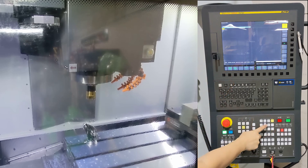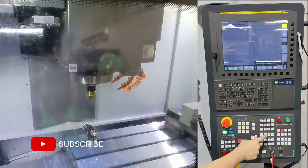Exit the program restart mode by pressing the program restart hard key. Note the LED is now off. Now that the alarm has been addressed, we can return to the Renishaw menu, enter the OTS, and proceed as normal.